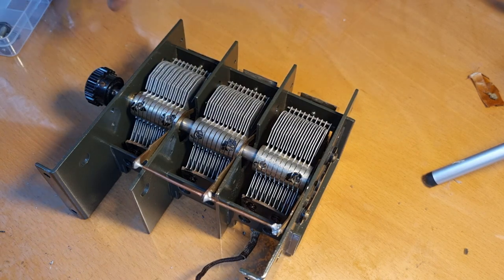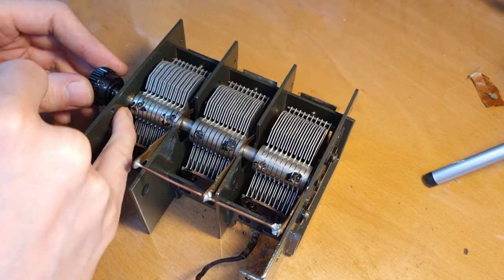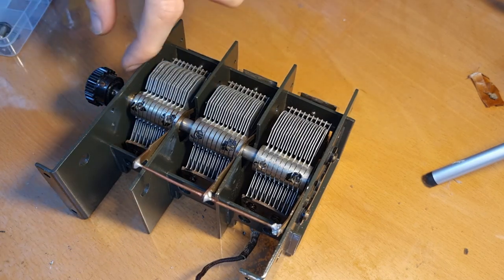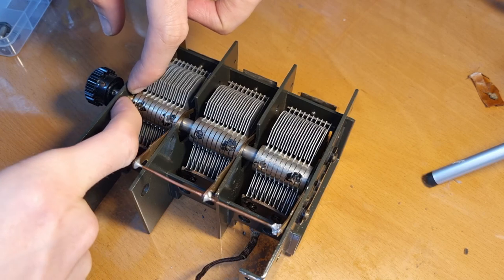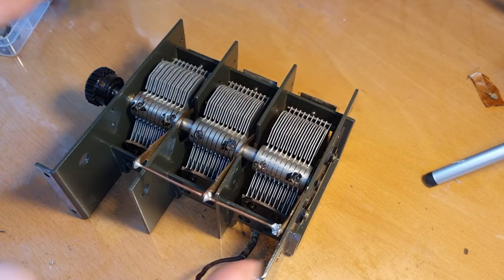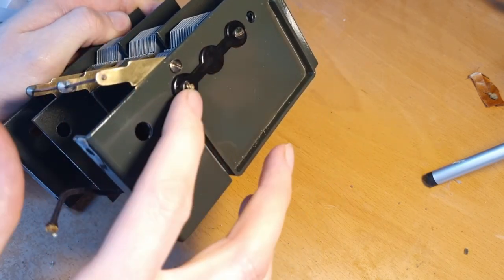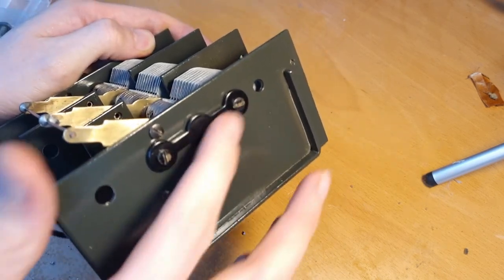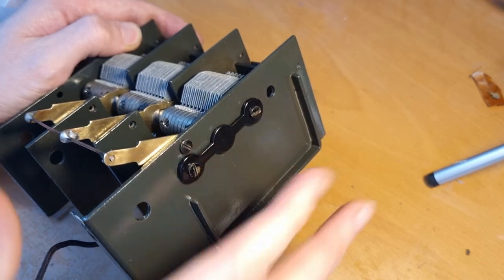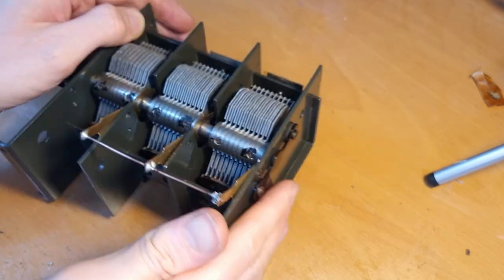So first thing you do is you put the shaft in from the right hand side here. This washer here also goes, it's not really a washer because it has a flange. That goes here from the right hand side also. So that basically stops the shaft from being able to slide left and right. Next you close up with this part here. Notice I've also painted that one black, gave that a new layer of paint as well. So this you use to seal the shaft in place, okay?